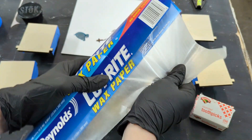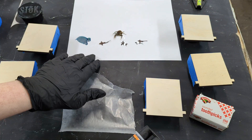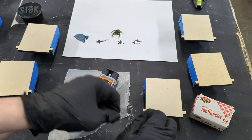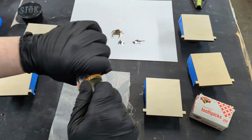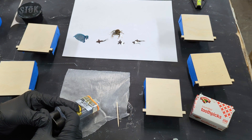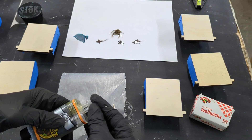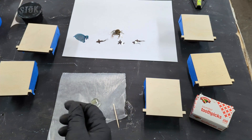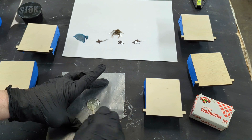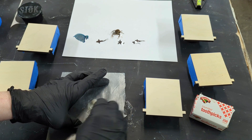For my boxes, I'm going to use some painted transparencies. I found some on different resin supply sites. I'll also have some unique ones on my website, which is linked in the description below. I found if you paint the underside white, it really makes the colors pop. Once the paint is dry, I mix up some clear 15-minute epoxy. You want to make sure that the cutout is secured to the wood before pouring the resin, otherwise it will float to the surface.